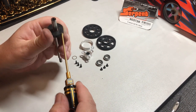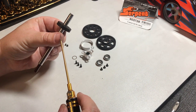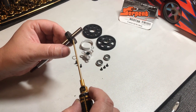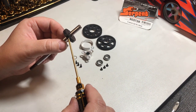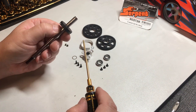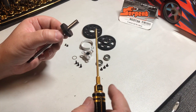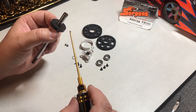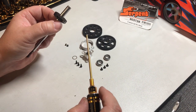And five on that side. Our springs should be set nice and even on both sides. It's very crucial that the setting is the same either side. You can get your verniers if you want and measure the distance of the screw — some people find that accurate. I usually like to bottom the spring out because the springs can be manufactured differently sometimes. There's personal preference, but just as long as they're equal side to side as best you can, that's what we're looking for.